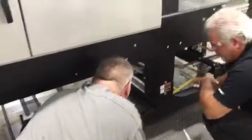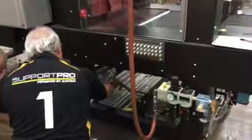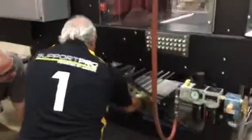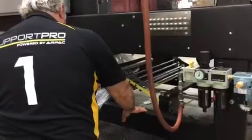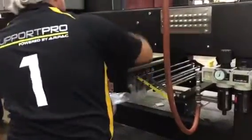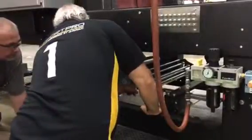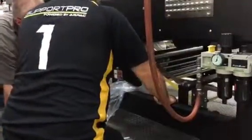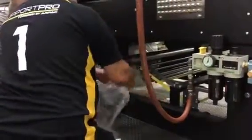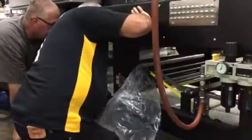I'm not worried about that because I'm not going to turn that thing down. You're through there. Now, what you want to do is push these down and lift your dancers all the way up in their held position. You don't have to thread this all the way up and down — you can throw the film on top of each one of these. Let's go ahead and push this back and let you thread this through.